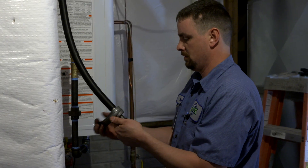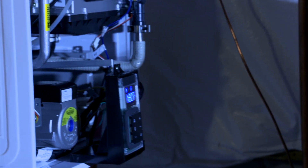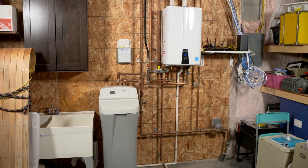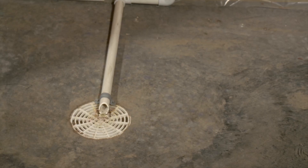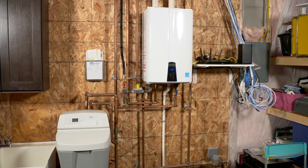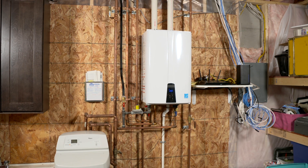In a new house you build for it, but what about an older house retrofit? As long as you meet all the standards — the BTU rating, you can run the flues outside without being near a window, and you have a floor drain nearby since it's a standing unit — if you have all that, then definitely. What's a disadvantage to having a tankless system? It has to have maintenance once a year. We have to come out and run a pump through the tank itself to get it cleaned out and decalcified.